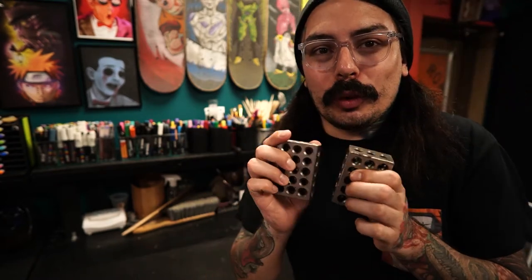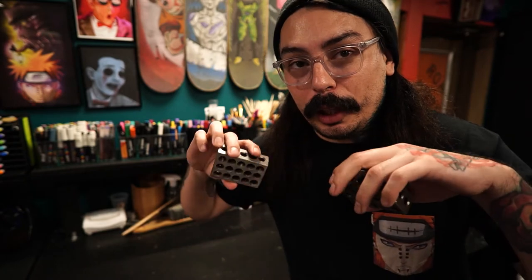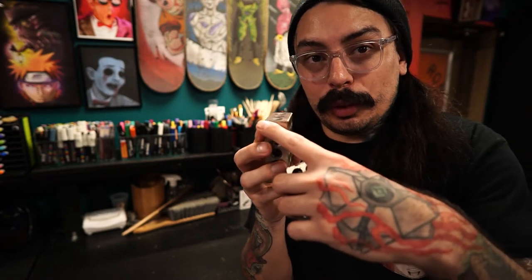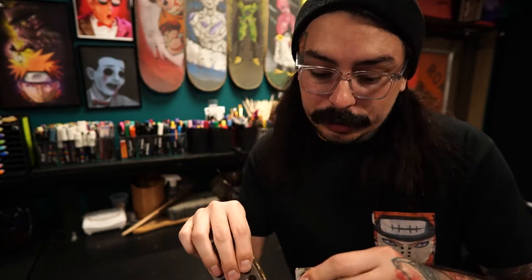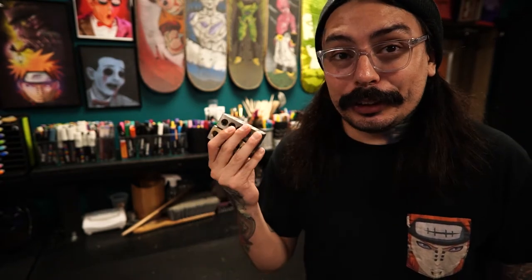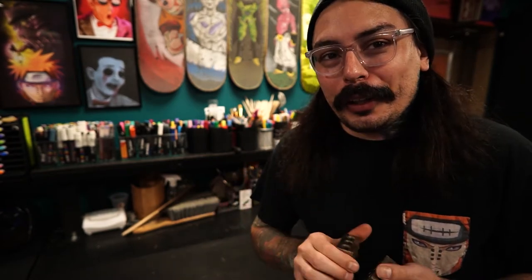Side note — I'm going to show you these blocks. These are really funny; everyone sees them and has no idea what they're for. They're called 123 blocks. They're literally just weights — you could use them for many things, but I got them as weights. They hold down paper really well if I'm trying to pin it or trace out a pattern. They're called 123 blocks because they're one inch by two inch by three inch, so on the fly you can do quick measurements. They've become so helpful — these are so useful and they're just little steel blocks. With the holes in them, you could even hold brushes or pencils. I get excited over neat little tools that I can find a use for.